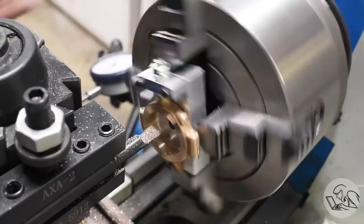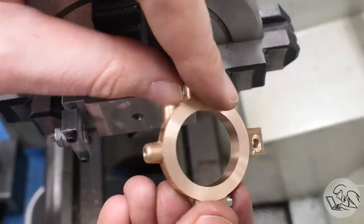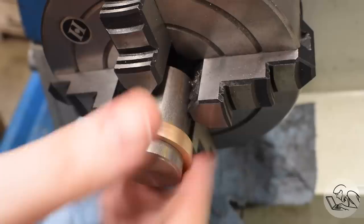That's looking good — some deburring to do but basically done. On to the eccentric: I cut a groove in the bar stock to the exact dimensions needed, and that's a good fit on the strap, moving freely.